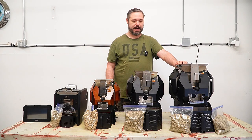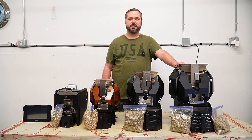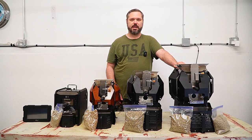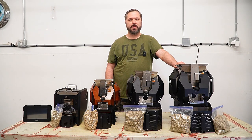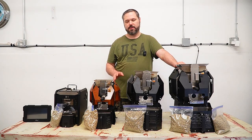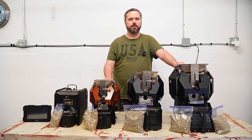People ask all the time about running these every day. The Kaleido factory tells us they've run an M10 for as long as 40 hours straight just for testing and it just kept going. Some small shops run a similar M10 multiple times a day to roast beans for their coffee shop. They're built really high quality, built to last, and built to be maintained — don't think it requires zero maintenance. If you do need to replace a heating element, failure tends to be very early — infantile failure — and if they do fail you replace it and you're good for quite a few years. It's a cheap and fast replacement, and that's probably your biggest consumable.